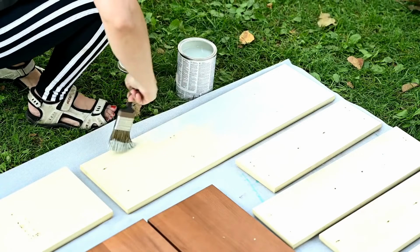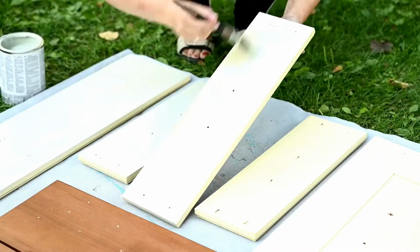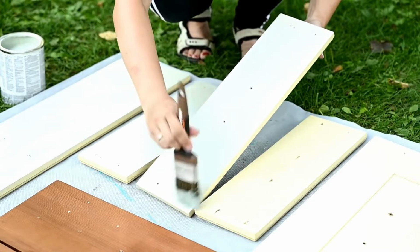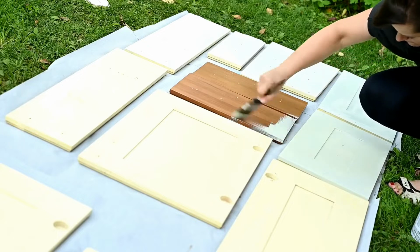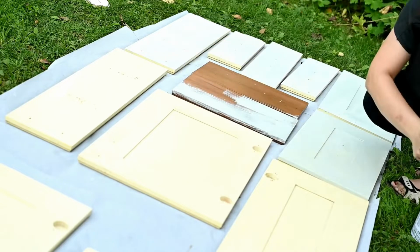Most kitchens have a very smooth, often glossy finish, because smooth ones are easier to care for, but paint will not adhere well to such surfaces, so a good bonding primer that increases adhesion of paint to the surface is a must. You can prime any material with such a primer, no matter if your kitchen is of solid wood or MDF board or anything.